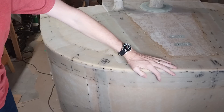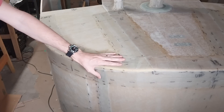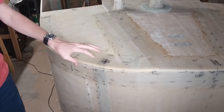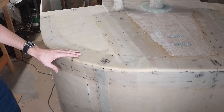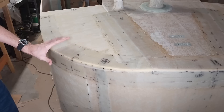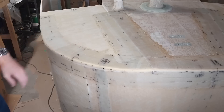It's pretty wild to see the first deck-to-hull joint fiberglassed over on the boat. This is two layers of 10-ounce cloth and a layer of 6-ounce cloth, ranging in width from 20 centimeters (about 8 inches) down to 12 centimeters (about 5 inches).